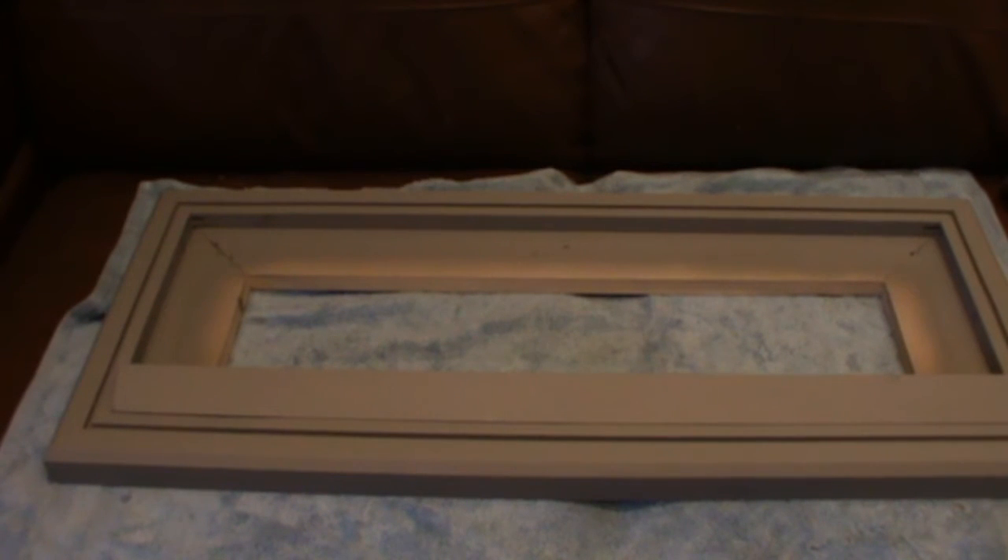The wood filler did say that it would take a stain, so I went ahead and put one coat of stain on there. The only problem is the wood filler did not take the stain. So you had these really ugly yellowish blobs all over the place while the rest of it darkened down quite nicely — that was a bit of a no-no. So what I've had to do is go back to painting it. It's going to be a gloss black to begin with because I need to get a couple of decals on there. Once the decals are on I'll put a matte varnish over the top.